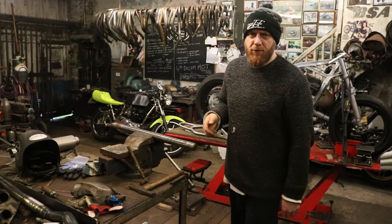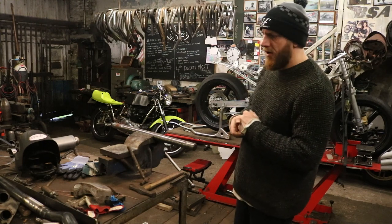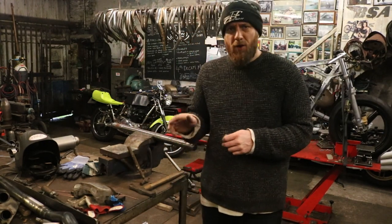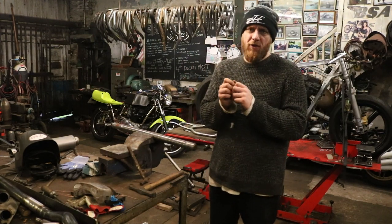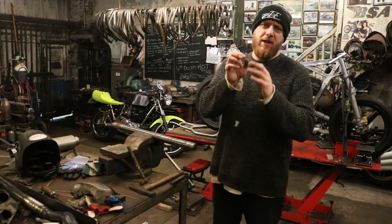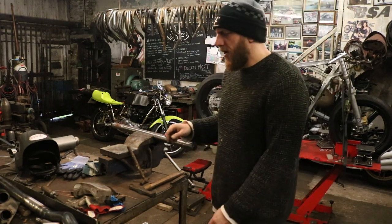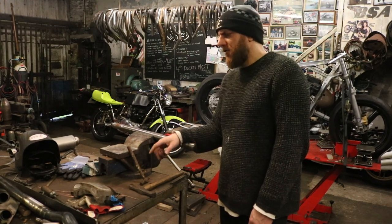Right, guys, let's do it. I'm going to drag gas bottles over, get some prepping done. Basically, I need to whip the grinder out, pull the extension lead over here. Probably just take a bit of the black scale off where I'm going to braze these on, mainly because they're really horrible. You should take the black scale off, but they're also really tricky. You just have to throw a little bit of braze on, that's all you need to get them to stick on. So you don't want it to be dirty because the braze will go everywhere. So I'm going to do that.